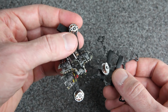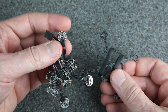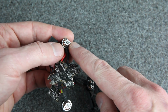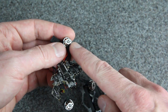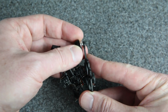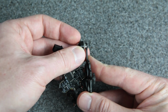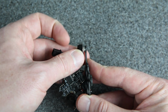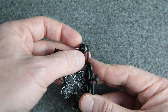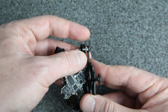The bottom of the motor looks like this. For whatever reason, EMAX likes to use proprietary parts on their builds, and these motors are no exception. I think it's cool that they only have 2 holes here, but it's just not standard. That's 6.5mm apart. I measured it, and if you stick it on the arm, you can see it goes on like this, and the bell actually sticks out a little bit past the arm. So I was kind of concerned about that. It means that an impact could hit the bell, and I don't think these bells are going to be super durable. They're designed to go inside of that Whoop style prop guard, and so they're kind of exposed here.